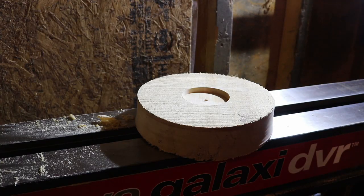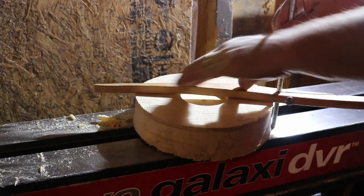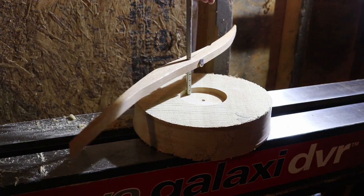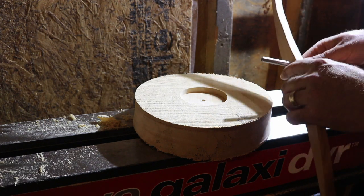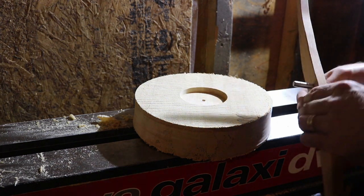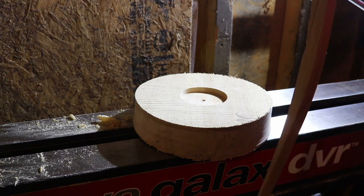The way this works is you set the gauge to the depth of your material. The reason I put the notches on there is so you can gauge how deep your mortise is. You can then loosen that off, back it off another half centimeter, and that's how deep you can turn for a half-centimeter-thick bottom.